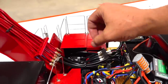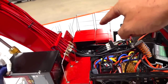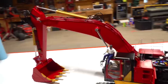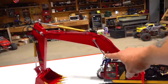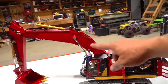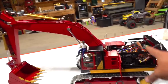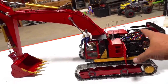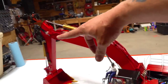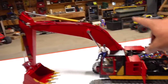Yes, this is a gargantuan motor. It is like the size of my hand. Normally, motors like this don't have enough speed to get up to speed to help the pump in the mix soon enough. What am I talking about? Well, when I move the boom stick and I want this whole top boom to lift, that's when I want the pump to turn on, not running all the time making tons of noise, because it's noisy enough with the fans. And yes, I could put a sound kit in here if I could find one that I liked. And so what I want is when I go to move the boom stick forward, I want this to only turn on the pump as well.